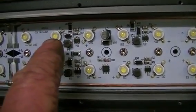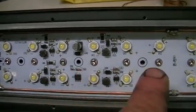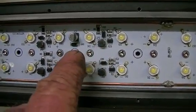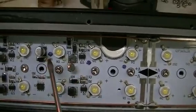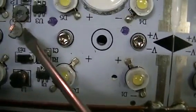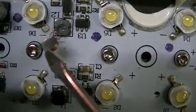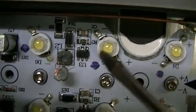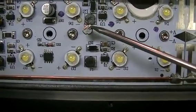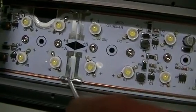This circuit here will drive one to the left, two to the right, and so on. So each little circuit drives three LEDs. I found the problem with the three I've marked with a black dot that are not working — it just happened to be the same three that are right on the circuit that has this broken inductor here. That is why those three are not working. One module runs from here all the way over to here, and that is one complete module.